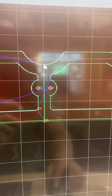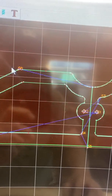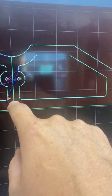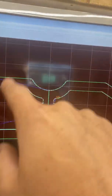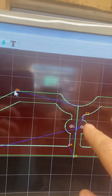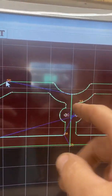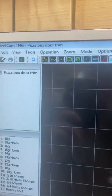Then it comes over to S4 and leads in to cut the inside of the other door panel. My very last cut is the perimeter — S5 is my dividing cut and S6 is the final cut. So it goes to S5, does its cut, stops, follows the blue line, lifts up, shuts the torch off, touches down at S6, and cuts all of S6. You can change the order — I'd probably cut S6 before S5, cut the whole piece first then cut it in half — but this works just fine.